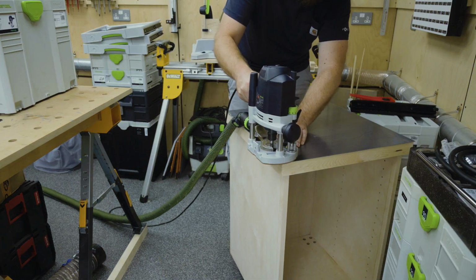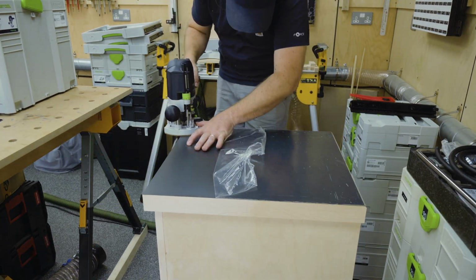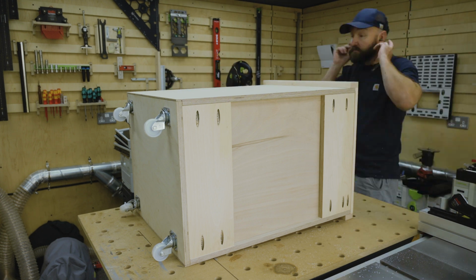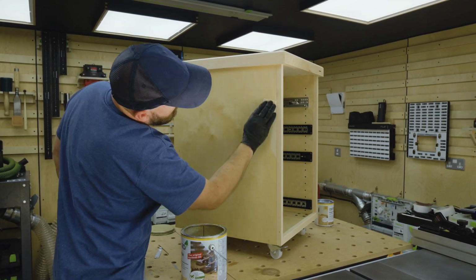With this done, you can now add a chamfer with the router to the 4 bumper faces. I went with the 5mm chamfer using a bearing guided bit. At this point, I used a combination of an Arris roundover bit and hand sanding to smooth all of the edges. Last step with the cabinet box is to add whatever finish you like.